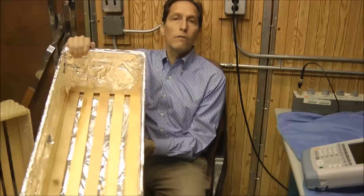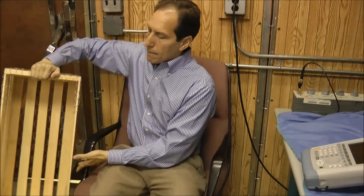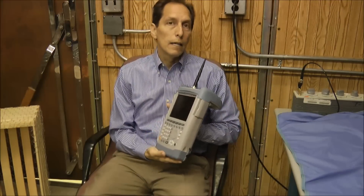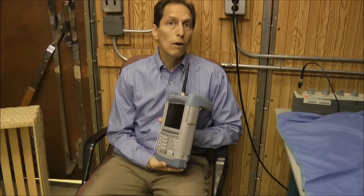So what I did is I created two boxes, both of them out of wooden crates. I wrapped one with aluminum foil and left the top open. The second one I wrapped with one-inch chicken wire all the way around, again with the top left open. The reason I left the top open is I'm going to put a portable spectrum analyzer inside the Faraday cage so that I can make a measurement of what RF energy is received.